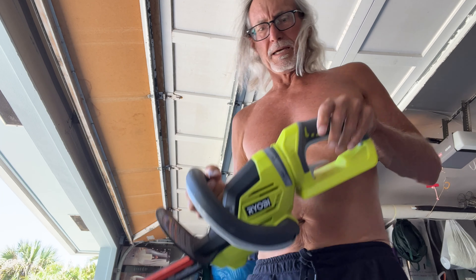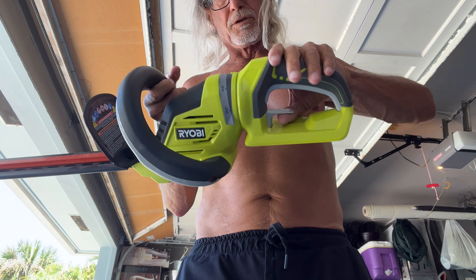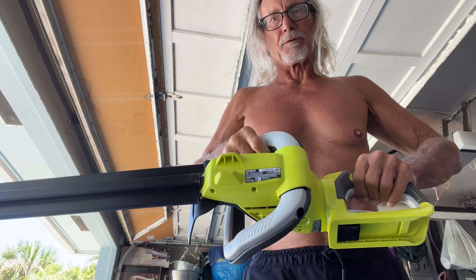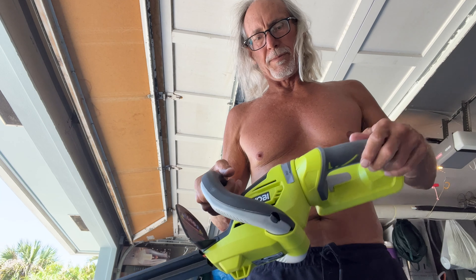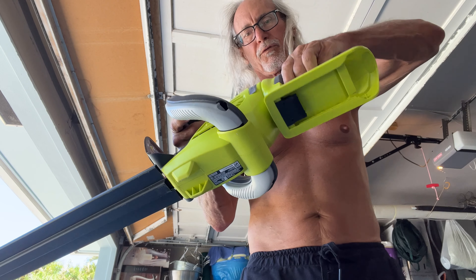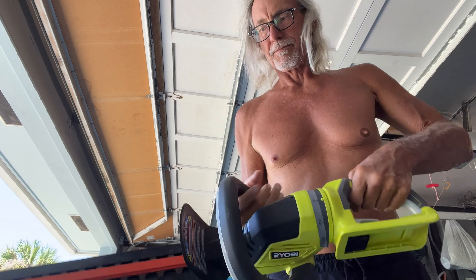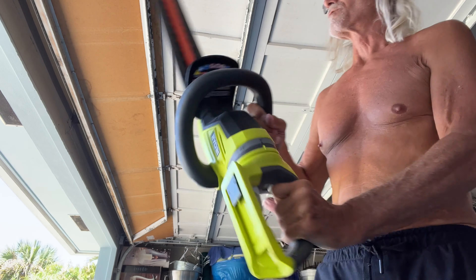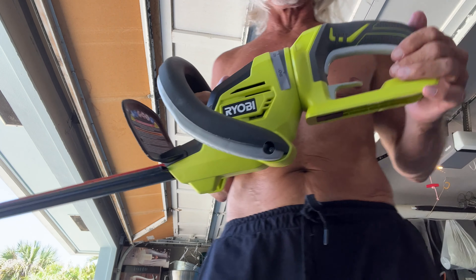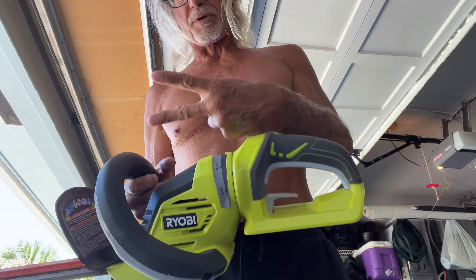Remember, you've got to put your sheath back on. When you're all done and you've got your battery out, just slide this baby in there like that — and that's ready to go. Now, to change the angle, you take the handle and turn it. From anywhere on it, when you squeeze both triggers, it runs. You can go 45, zero, 45 on the other side, and 90 degrees — so you can cut a hedge right at that angle. And that's how you do it. If you like this video, subscribe to my channel.